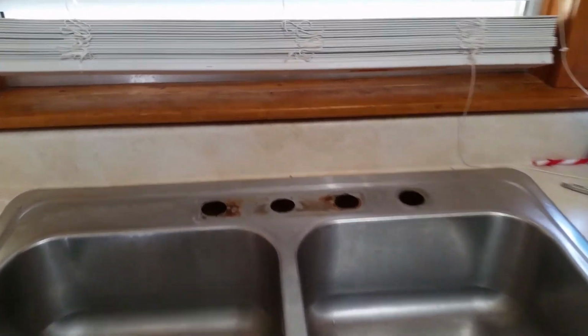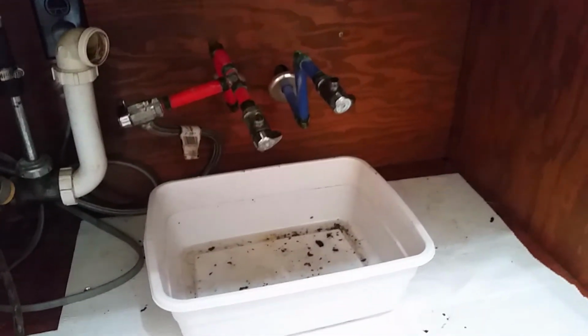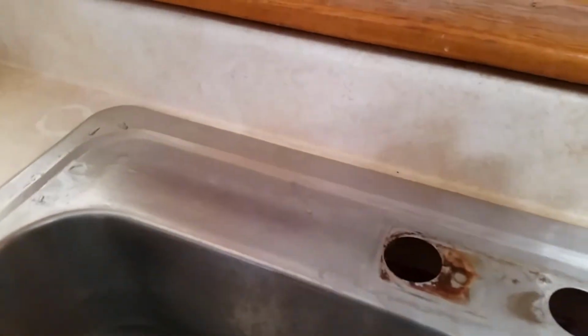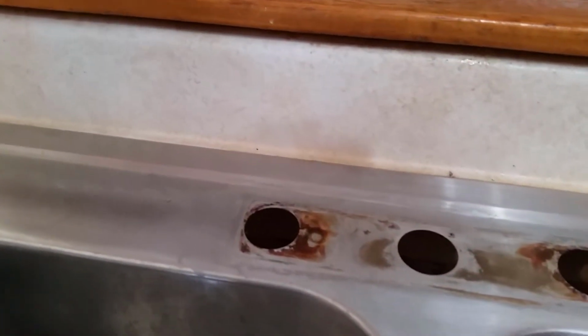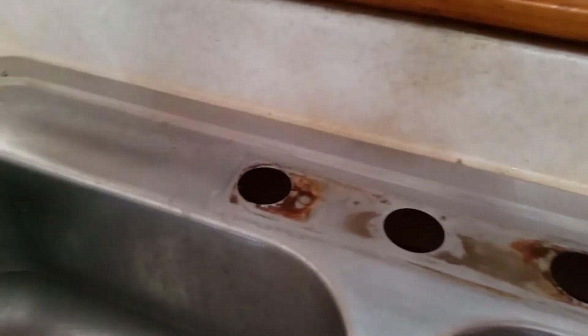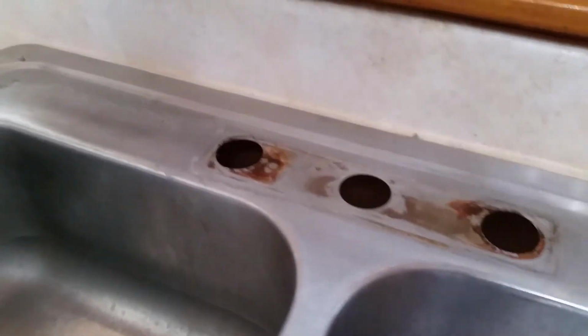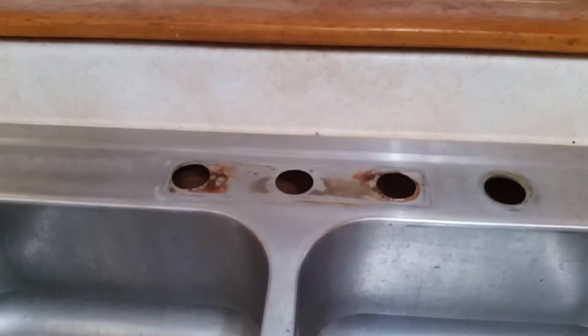Got it off, got the top off, got pretty much everything cleared out from underneath here. Now I have to work on that one. That is the disposal's attachment. I may do the entire next video over on installing those because they're kind of a pain in the rear. But I do want to tell you, you need to clean all of this junk off if you replace your faucet. Don't just slap down the new one over these little areas of rusty stuff. Get it all cleaned off. That way your rubber seal on the bottom will seal up. So I'm going to get back to it.